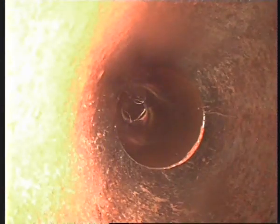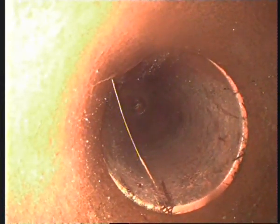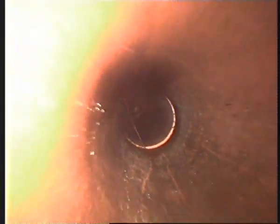Okay, so this is a 550mm depth from the ground. We'll measure it as we pull back. It's still 100mm diameter clay pipe. This one is not too bad — I'll look at the next joins. Yeah, you've got a bit of tree root going through here, very small ones, but going through.